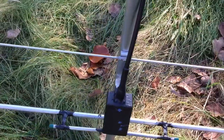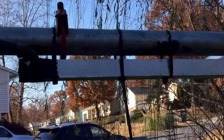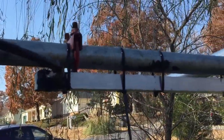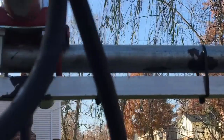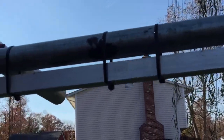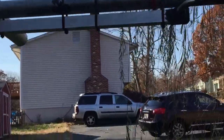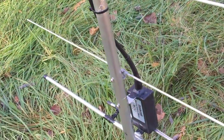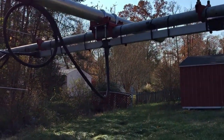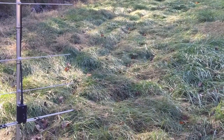These antennas are just leaking from the factory. This is a homemade power divider that I made — I can put the specs up if anybody is interested in making one themselves. It's easy and fairly cheap with parts from Lowe's or Home Depot, except for the SO-239s of course. Both feed cables have to be exactly the same length. It checked pretty good on the analyzer — no more than about 1.1 SWR across the whole band. They should work pretty good.